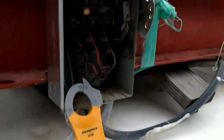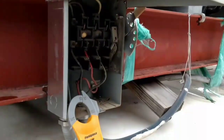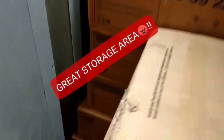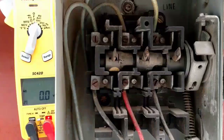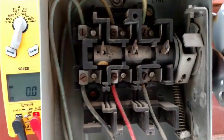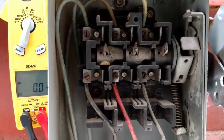After confirming we're missing a leg of power, that's going to be our main issue. Let's go check the breaker and see what we get and go from there. Coming down to the breaker area — that's not my box, that's not my box, that's not my box — that one right there is ours. So what we're going to do is refer them to an electrician to get that electrical problem resolved. But other than that, they have an evaporator fan motor they want us to change out, so we'll go check that out.